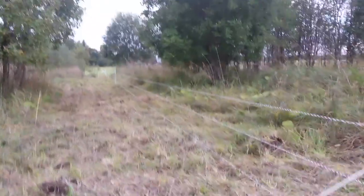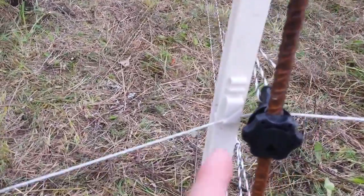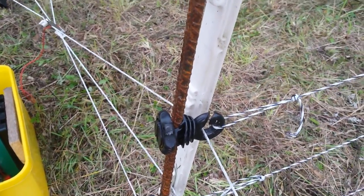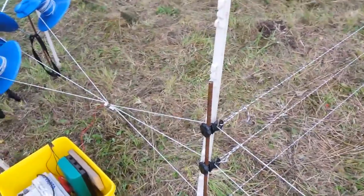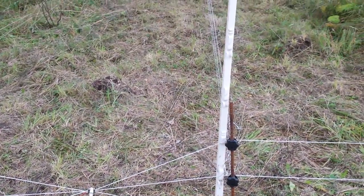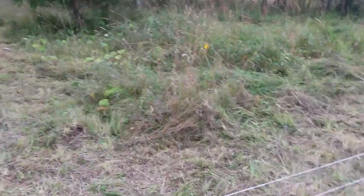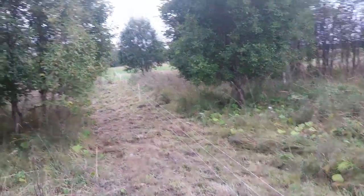After that second post you can see the line isn't that taut. If you have corners like these - with a normal post the wire goes through and everything's fine, but in a corner if the wire goes at an angle it's tensioning it and you can't pull the wire through easily. If it's like four posts in a normal shape fence it's fine, but here I have six corner posts and it seems to affect how much I can tension it. But it's fine.